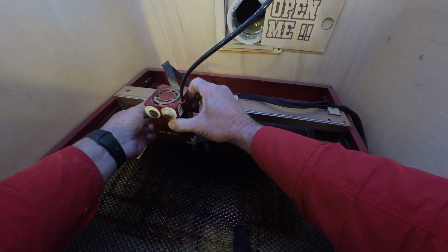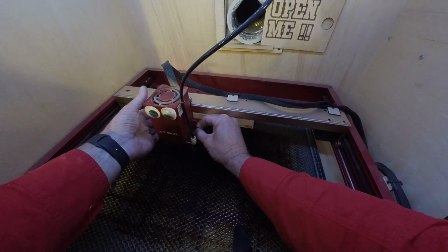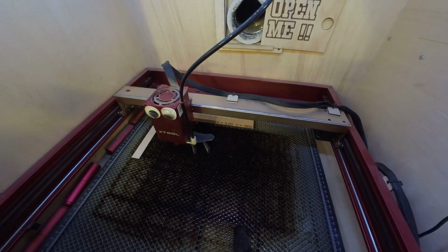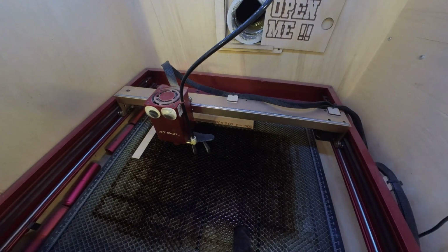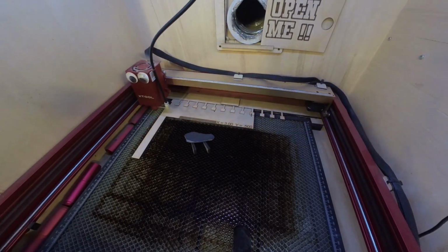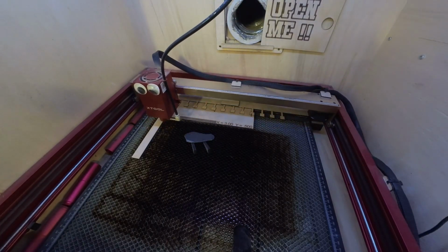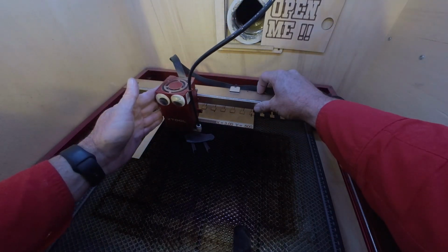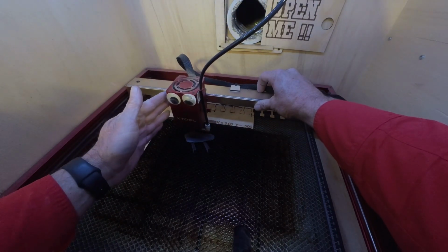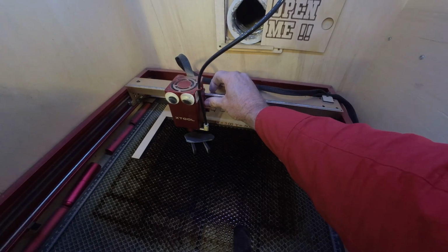Now, I'm not going to go over this twice, so the absolute coordinates thing doesn't really matter that much, okay? So I'm going to gently lift that. So we got focused. I'm going to go ahead and home my laser just so I can have an idea. Okay, so going to home. Now I'm going to frame it. It's clear up there. I'm going to move this down. Give a rough guess, about like that. Okay. Scoot it over just a little bit.